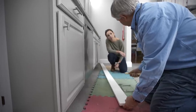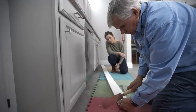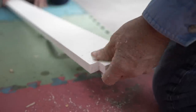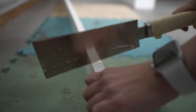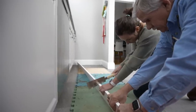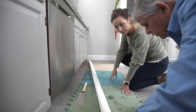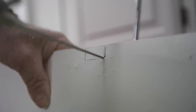We could do it with an electric saw or a hand saw — we're going to use a pull saw. I'll cut this one on the end and let you cut those. Line your shoulder up with the handle of the saw and let the saw do the work. To cut across the bottom line we'll use a coping saw — the blade is on an angle, so come across slowly and turn it until it's flat enough to come across.